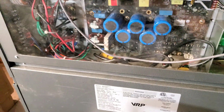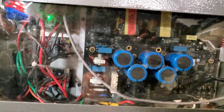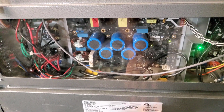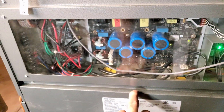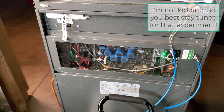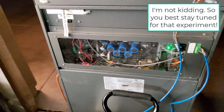I don't see any other power supply that's off of the 60 hertz AC voltage, like a little transformer or something. If it had a little transformer going to another little side power supply, then you couldn't do that. You would need the AC voltage going through there, so it'd go through the transformer and everything, but I don't see a transformer on these boards. But who knows, could be mistaken. I'm gonna try it when I get a spare board. I might even maybe just try it on one of the broken boards, I guess.